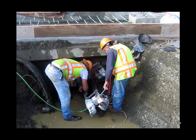It was very simple and inexpensive to place the conduits in the sidewalk area, but to hang them under the bridge, to provide the appropriate hangers, perhaps to drill and attach hangers to the structural members — all of that is really a significant effort which could have been avoided if the details in the sidewalk had been more carefully worked out.